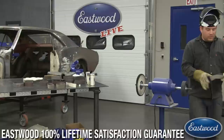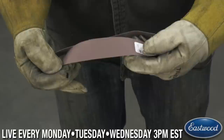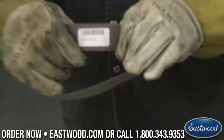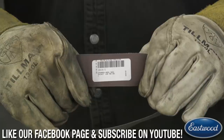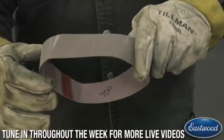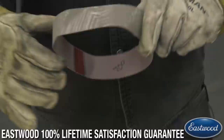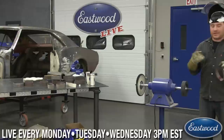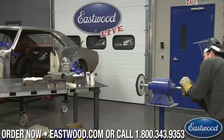Some of the less aggressive ones — when you start getting up to 700 and above — there's a part number printed on them but not a clear marking of what grit they are. So when these get thrown in your box or cabinet, you can't tell. The sticker from Eastwood has the grit on it, but when you lose that sticker — which will probably happen the first time you take it on and off — you're out of luck. So what I like to do is write with a Sharpie right on the inside of the band the grit, once or twice throughout. That way you don't get them mixed up.